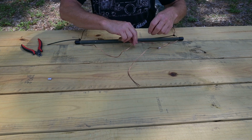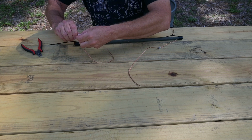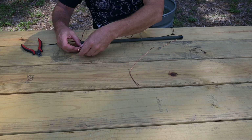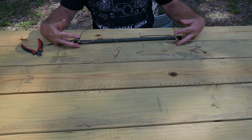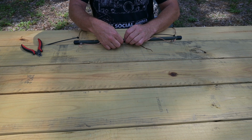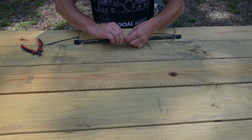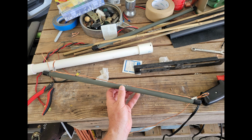Now go ahead and place your crimps on and make your loops, giving yourself about an inch. Now you can see what we've done here. We have both of our loops. Now what you'll do is you'll go ahead and apply a crimp to these 2 crimp ferrules, and then take your elements, cross them over like this, and wire wrap 3 times in either direction, opposite twist. Now flood your splice with solder, and this is what you should be presented with.